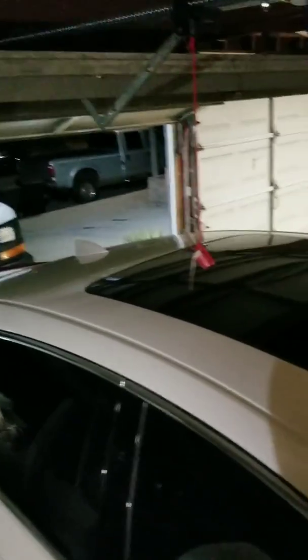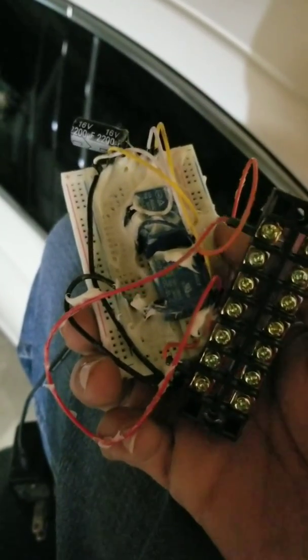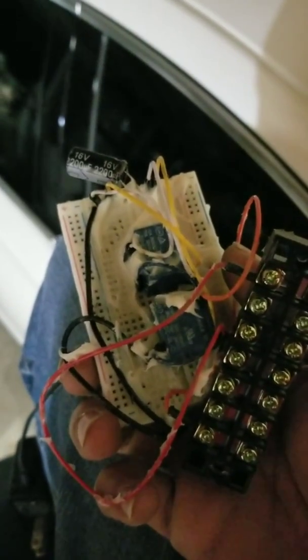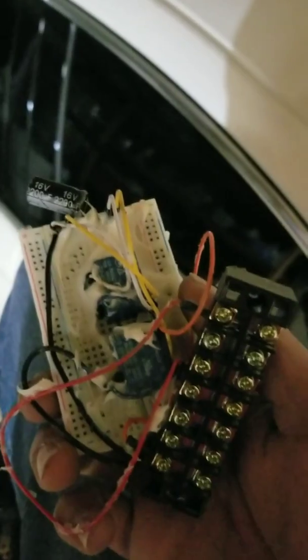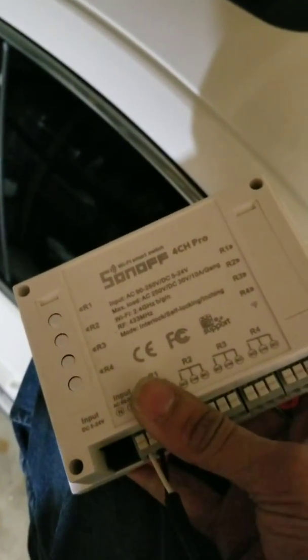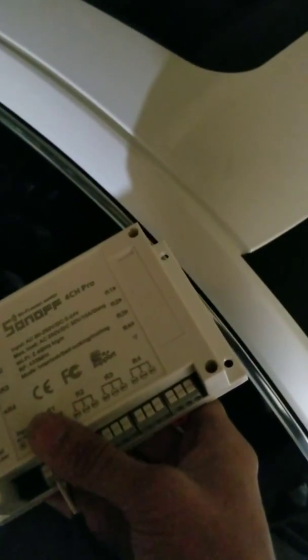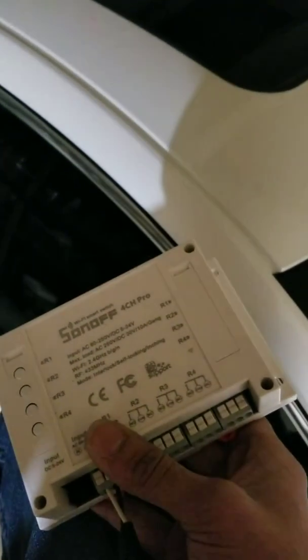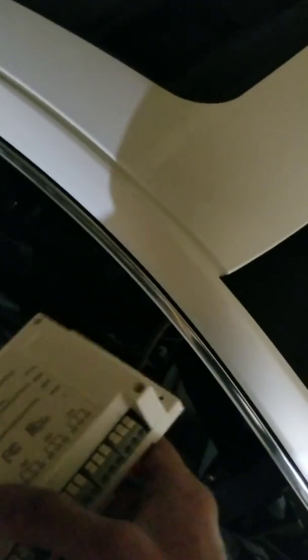Okay, so don't laugh — this is my old device. It basically uses a series of two relays. In the previous video I just used a resistor, but I ended up changing it to two relays so it discharges quicker because I hate the toggling thing. The reason why you'd want to switch to this device is because it has inching mode — what I'm calling momentary.